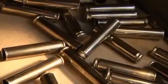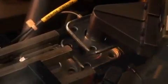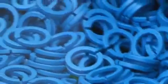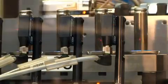The armature tops are flanged into the armature tubes. The armature tubes are welded to the flanges. In this process, a spacing ring is also mounted on each armature tube. The spacing ring ensures that the coil O-ring will be compressed enough to form a moisture-tight seal between the coil and armature tube.